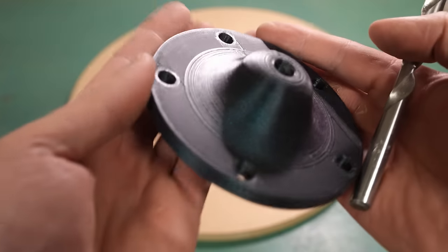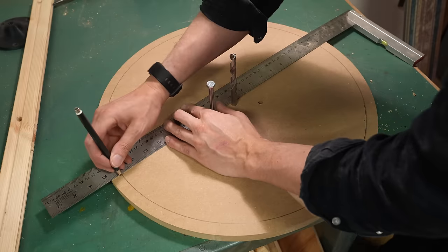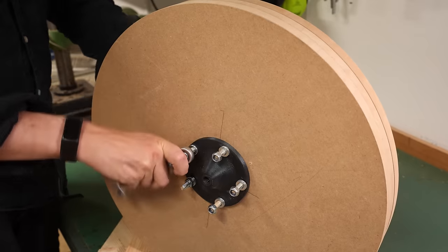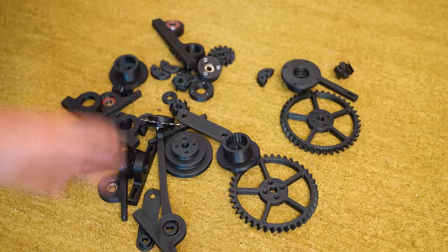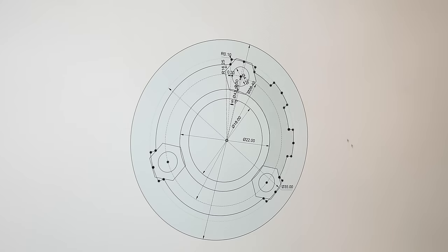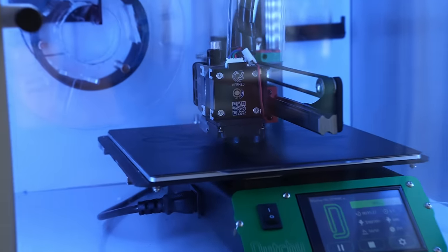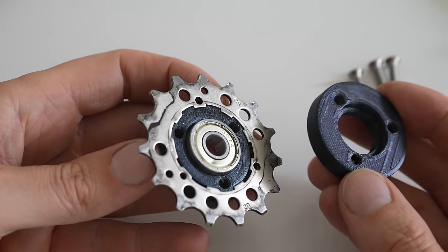Very, very satisfying. I drilled through the 3D printed hubs for the bolt holes, and could then use the center pivot to draw a circle for screw holes, and then use the bolt holes to draw the hole locations along the rim very accurately. So that was all the parts done, and putting it all together I had a really nice looking flywheel without using CNC — and it was super fun figuring this process out without CNC. Then I 3D printed a bunch of parts, but the most fun was creating these hubs for the bike gears. I took a picture of the gears with a ruler in the shot, then calibrated the picture in Fusion 360 using the ruler to adjust the scale correctly. I could then trace the internal shape of the bike gears and print the parts. I pressed a bearing into the part, and the gear clicked in place perfectly first try. Also very satisfying.